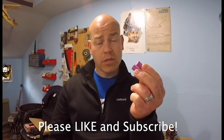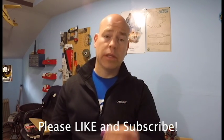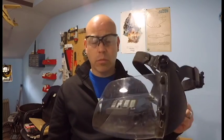Before we get started with angle grinders, there are two important things to know. Number one, they're loud — so have hearing protection, and more importantly, be willing to use it. Two, while safety glasses are great for pretty much anything in the shop, with angle grinders the best protection is a full face shield. Safety glasses will help protect your eyes, but composite discs have a tendency, when they wear down, to throw pieces of shrapnel. A face shield will protect you from a mouthful of broken teeth. So please, protect yourself.